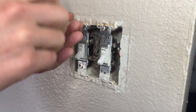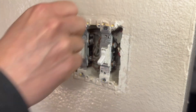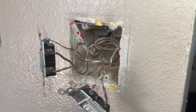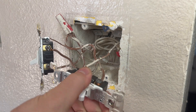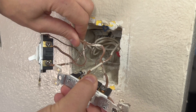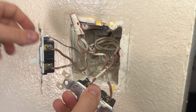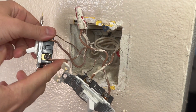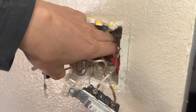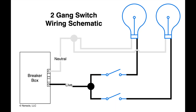You can also do a visual check by flipping the light switches and verifying that the lights no longer turn on. Now that we've verified that our circuit is off, go ahead and remove the switches. With the switches out of the way, we can now identify our wires. Here's where our live wire comes in and connects to both of our switches. The live wire runs to one switch with the output going to one light bulb, and we have the live going into the other switch with the output going to the other light bulb. Tucked in the back, we have our cluster of neutral wires. Just for reference, this is what our circuit currently looks like.